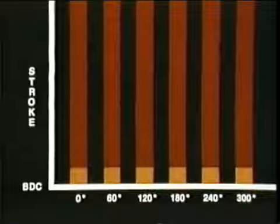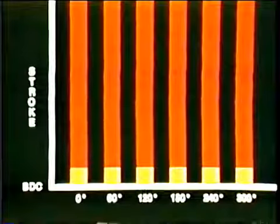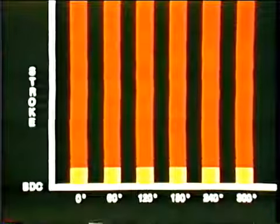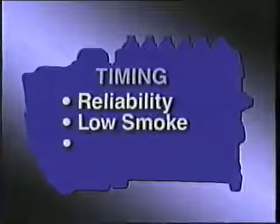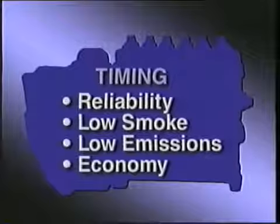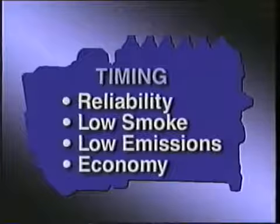When each cylinder is timed to port close at equal intervals, matching the specified lift of number 1, the pump is phased. Sometimes this is called internal pump timing. When you've done it right, timing can deliver pump performance that pays off in many ways. You've set your pump to properly pressurize the fuel and properly time the injection, taking care of the second job of the pump.